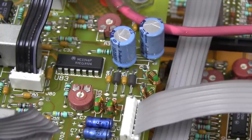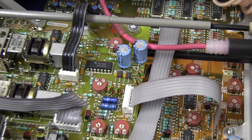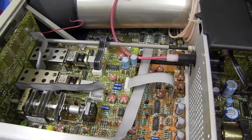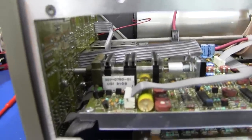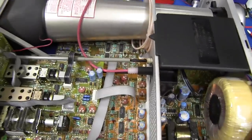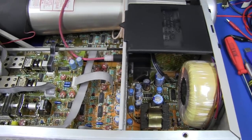One thing I'm not noticing inside this scope — and this is something you've really got to look for in vintage scopes, especially Tektronix ones — is custom hybrid modules. It looks like fairly discrete stuff. I'm not recognizing some of the IC numbers offhand, but they're certainly not custom hybrid type things. There might be a thick film resistor hybrid on the vertical board, but apart from that it uses pretty much all discrete circuitry — transistors, basic op amps, and 4000-series logic ICs.